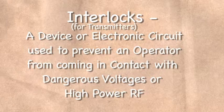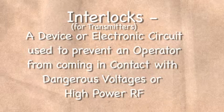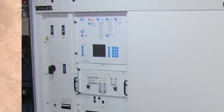There is a sequence of interlocks that must be opened in order to access the inside of the high voltage enclosure. The engineer must turn off the high voltage, make the adjustment, turn on the high voltage, check the idle current, and if it's not right, then the engineer must do it all over again, as this example shows.